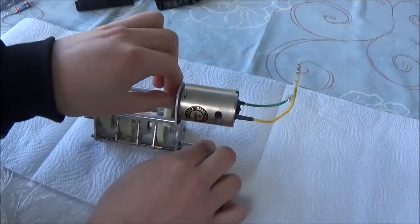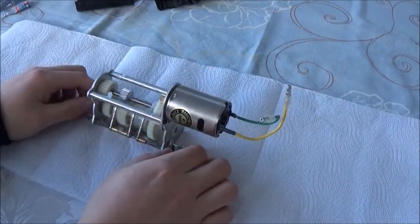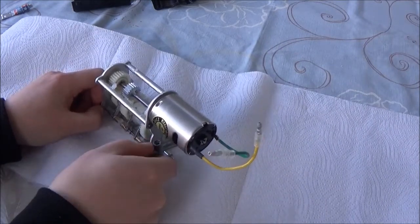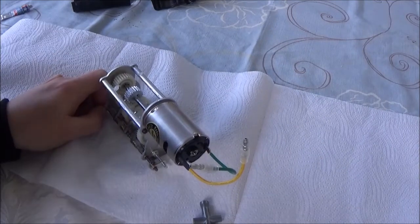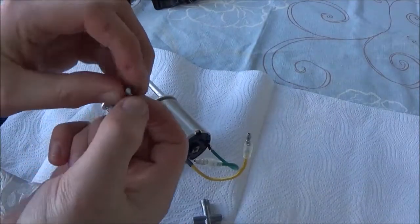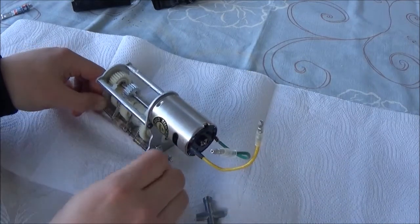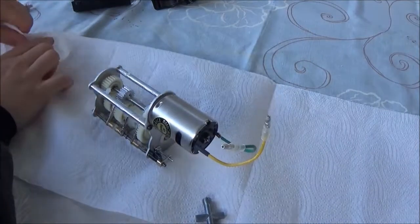What I do to all my trucks is make it so it's always in one gear. What you get is these two little clips. Don't drop them! You push it forward like that and clamp them in - and there you go, that's all it is. That keeps it in first gear, which is what I want. Because we run them in the house, and especially with this motor - it's a very powerful motor. When you pull it in top gear it'll turn into basically an RC race car.